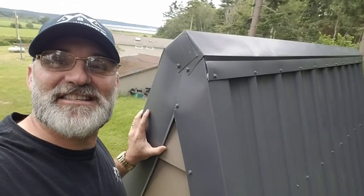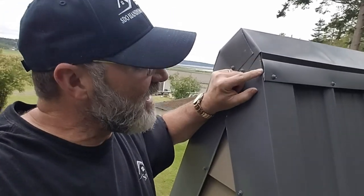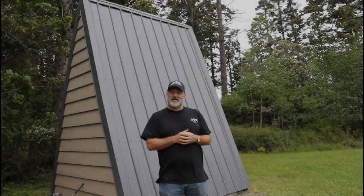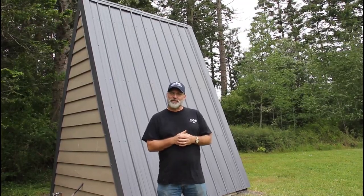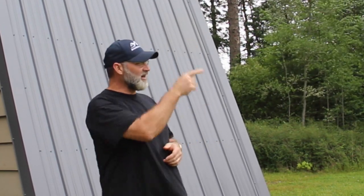So we just finished the last detail. You can see that end with the folds - makes sure the water stays out of there. Looks like water can come in here but it can't - there's a beautiful seam right in there, and even if water did get in it would come down over here and then down the ridge. Great job, well done. This project took us eight hours that we split over two days, but could be done in one day with some help - definitely bring a second set of hands. This is a homeowner intermediate level - difficult, but if you read the instructions provided by the manufacturer you should have no problems installing a metal roof just like this. If you have any questions, comments or suggestions put those down below, and don't forget to like, share and subscribe. Thanks for watching Dad It Yourself.